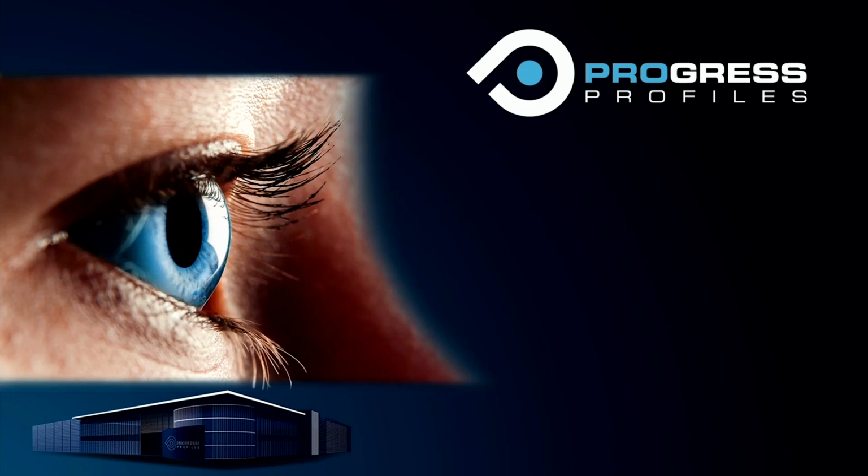So our boards are steam rated as they are. You don't need to add a new layer. You don't need to add a waterproofing membrane, roll-on, nothing. They are just ready to be used in a steam shower application. So the perm rating on our boards is 0.1. We're going to have some samples here in a few minutes.